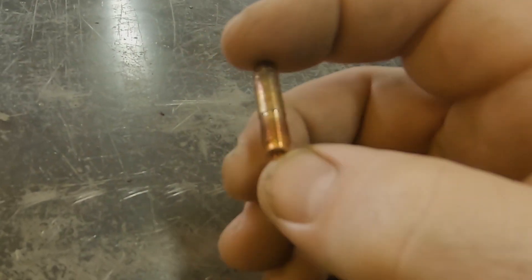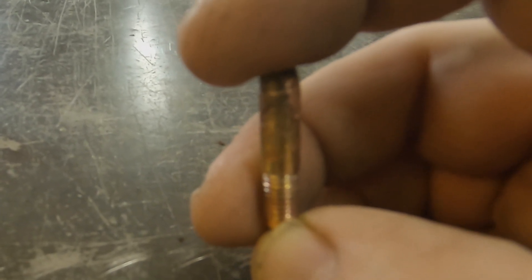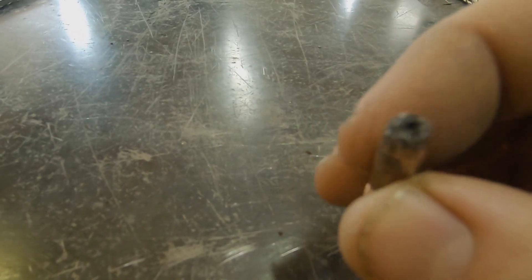When checking your liner, remove your contact tip from the gas diffuser. The contact tip is sized to fit your wire — I've troubleshot machines where the problem was simply the wrong contact tip, either wrong threads or the wrong size for the wire being used. This is your main electrical contact point for your wire; your welding current does not get conducted to the wire until it passes through this contact tip. A loose wire or a loose contact tip in your gas diffuser will cause difficulties.